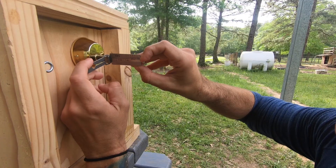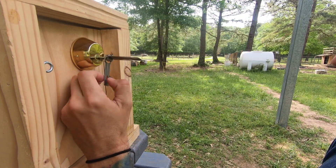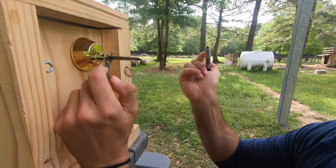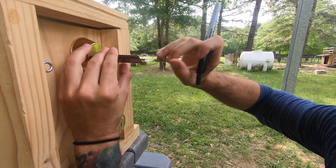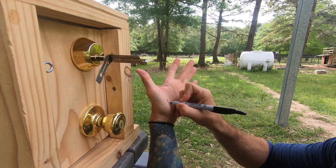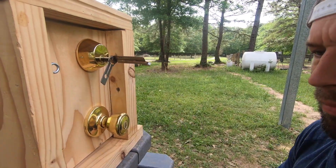This time we have temporary unrestricted access to the deadbolt. It does take some foreknowledge — you need to know what type of lock you're dealing with and bring the right make and model of Lishi for the right make and model of lock. But once you get your lock picked with the decoder, you then decode the lock by seeing how high and low each of the pin readings are.